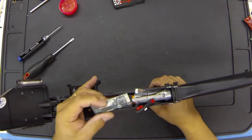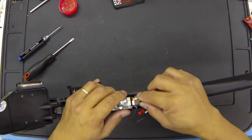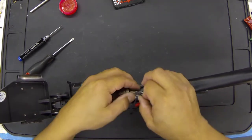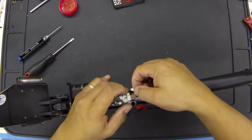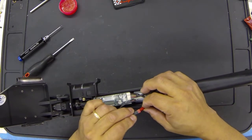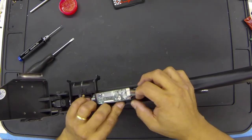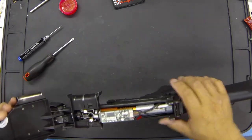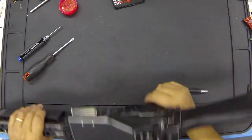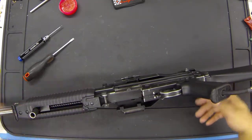FCU's got Velcro on the bottom of it. It'll lock right in place right there. The wire harness plugs right in. The GPIO connector, I usually go right underneath and goes into the GPIO port, and then you connect the FCU battery, and that's in place. Just sort of tuck that underneath the little FCU shelf. Good to go. There you go. Locks down.